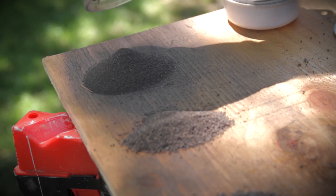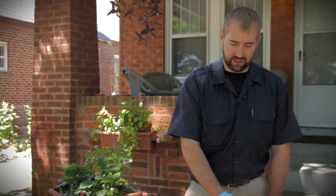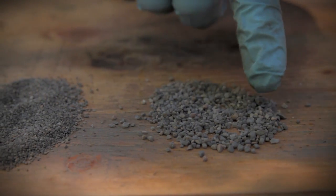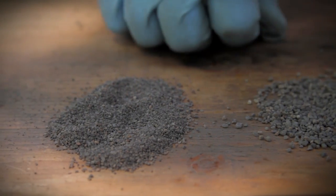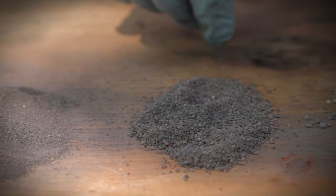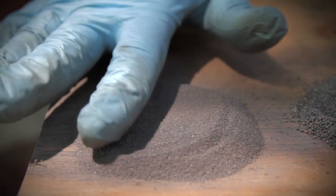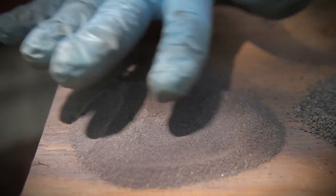When you receive your mortar analysis back from the lab, you can expect a few things: an analysis of the different aggregate sizes and their gradation proportions; what the aggregate is composed of — quartz, shale, or other rock types — to help determine what your aggregate needs to be; and the ratio of binder to aggregate, giving you a recipe for how much lime, Portland cement, and sand or aggregate is necessary for your match. Make sure you go all the way around the house and take multiple samples. And when preparing your mortar, don't rely completely on the recipe — make up several samples, let them dry out, and then make your decision on the final recipe.